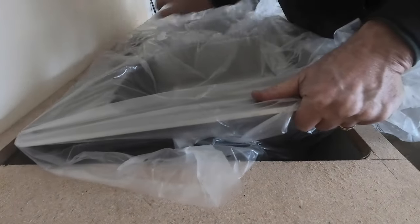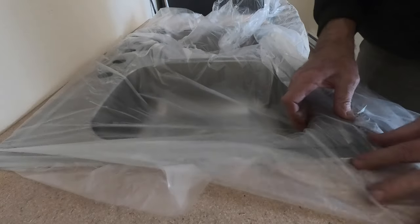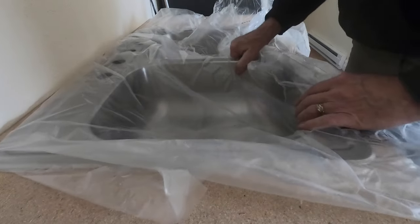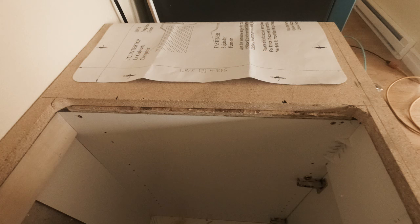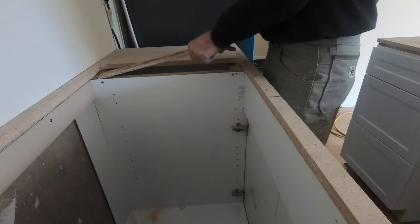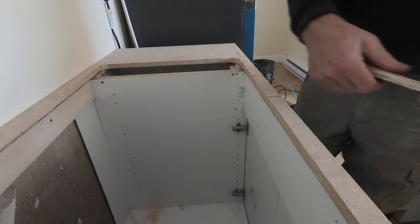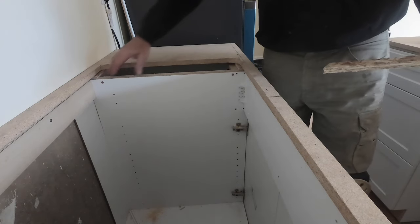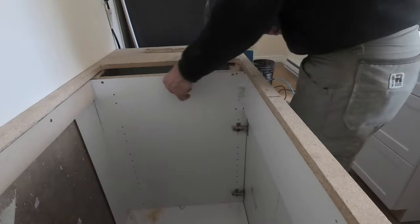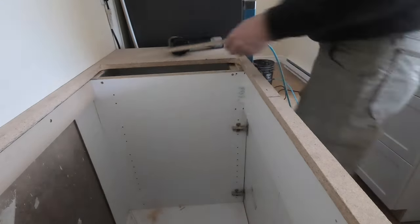It's a good idea to check the fit of the sink at this point. Make sure the corners are covered and there's a little bit of play for the plumbers to do what they need to do. The OSB blocking on this side of the sink is interfering with the sink clamps — the other side is okay. Somebody's going to have to cut a path for the sink clamps, but most plumbers don't want to deal with that, and I don't want to cut little paths for the sink clamps either. Instead, I'm going to reposition the block before I nail down the subtop. Fortunately, it was an easy fix.